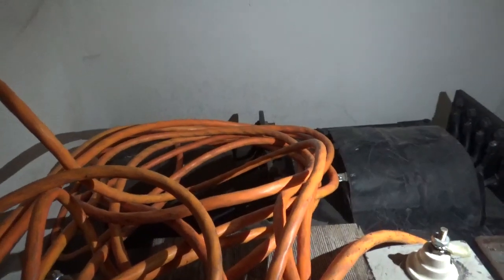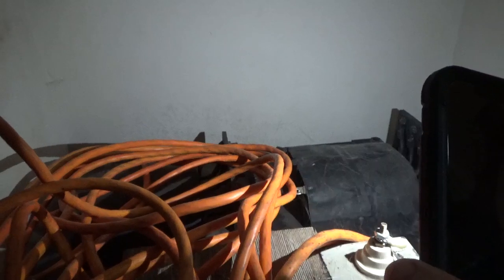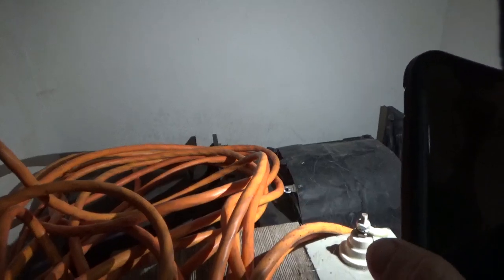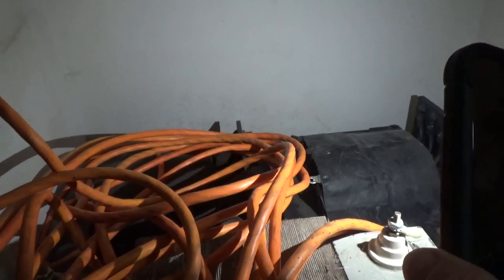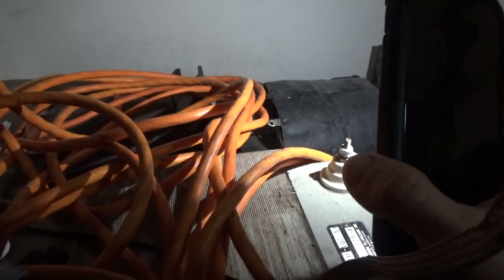I'll say again real quick before I go — this amp is not for sale. It's just something I'm putting together because I have the parts and I want to show I can do it. Actually, the guy who had me build a 6,000 is asking me to build a 3CX15,000, 160 through 40 meter amp — he doesn't want 20 or any other bands. He's outside the United States. I wouldn't use a rotary switch in that; I'd use really big vacuum single-pole single-throw relays.